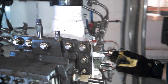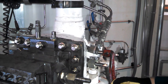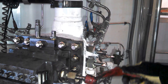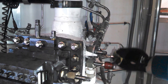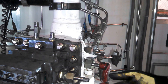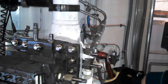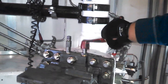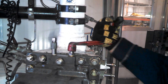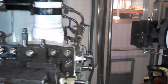On the side, just like we did before, open the gate to the open position, and we're going to roll the plate into service. Put the orifice plate into service all the way to the bottom. Now we can close the gate, close the bleeder, and close the equalizer. And now you're in service.